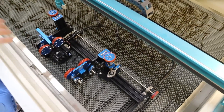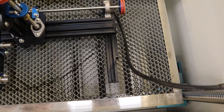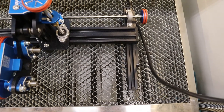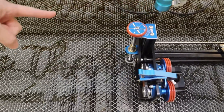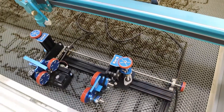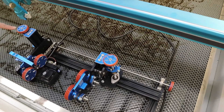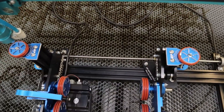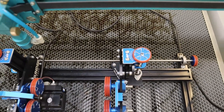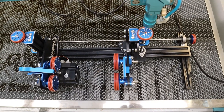Once it's plugged in, make sure you get it aligned, adjusted, and straight. We lined it up with the lines on the bed and it has magnets on it so it holds down firmly — you don't need anything else to keep it in place. Then we aligned it further by adjusting the laser head dot with the dots on the two top pieces of the RotaBoss, which was really easy. I thought it was going to take a long time but it didn't take any time at all.